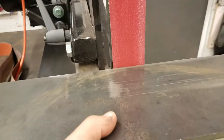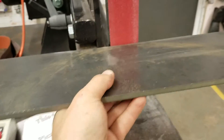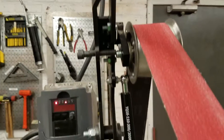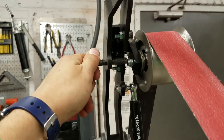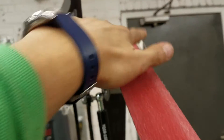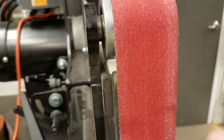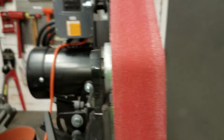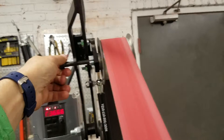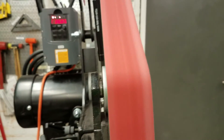Put the tool rest back to a reasonable place — you don't want to cut into it, so set it back a little. Up here we have the alignment guide. Turn this bolt to change the position. There are guides on the side to prevent the belt from coming off, but in general you want the belt to sit flat on this wheel. Turn it on and you can see it riding way off to the right, so loosen this a little and it jogs back closer to the middle — that's a good spot.